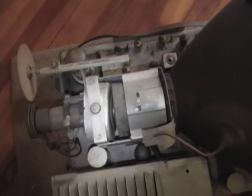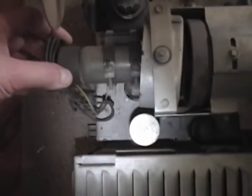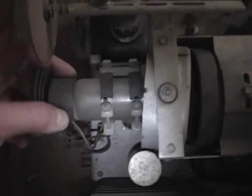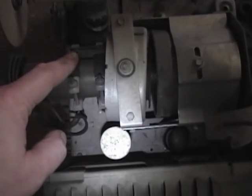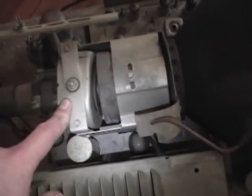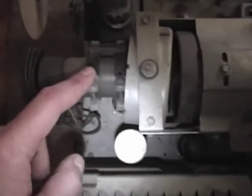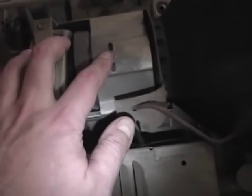I don't want to remove it right now though. You would have to take off the sockets — this one's a bit loose, I'll glue that on — remove the ion trap magnet, focus coil, and the yoke, then slide it out the front. Well, you don't have to remove them but you need to loosen them up. You'd definitely need to remove the sockets and then loosen everything else, then pull the tube out the front.